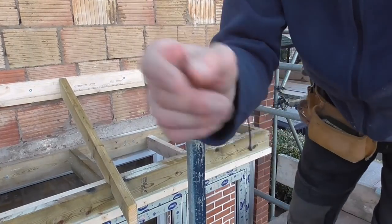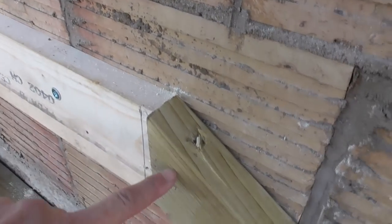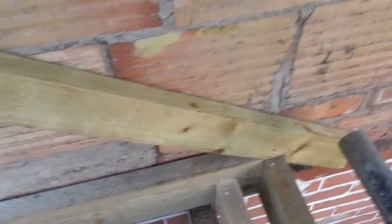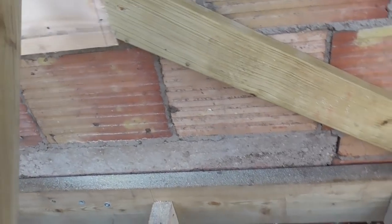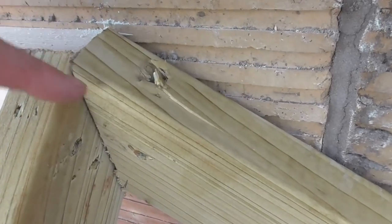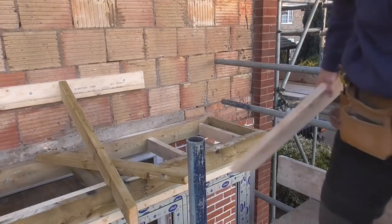Actually, I need to hold up here because I've got to alter the thickness of that rafter. The width of this plate on the top is narrower than the width of this rafter, so I won't get my true centre point. As you can see, it's sticking over. So what I'm going to have to do is either find a bit of material like this and quickly copy this rafter as a pattern onto it, or just rip this down a bit. Otherwise the corner point of the hip's not quite right, so that these two should meet in this corner here. So quickly do that, and then we can get those fixed, and then it's just a case of cutting the hip in. Right, happy days.